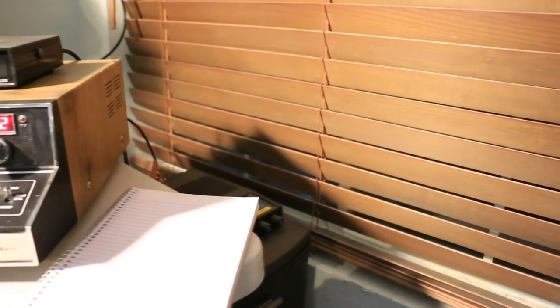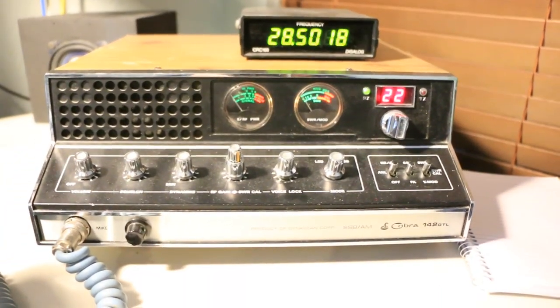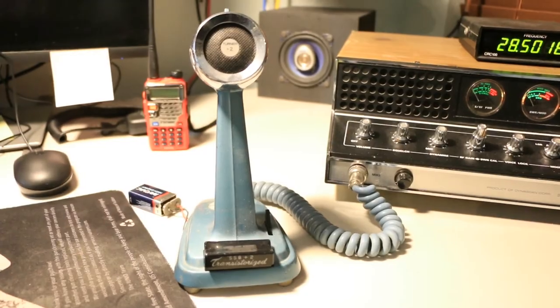Let's go back in time — I'm going to show you this old Cobra radio. I've had this for a long time; I bought it in the early 90s, it's a keeper. I've actually modified the audio circuit in this radio to allow more warm tones to pass through. I have converted it to 10 meters — it no longer works on CB legally. But it does work on 10 meters just fine, puts up more than 20 watts, and has fantastic audio for what it is. Let's take a listen.